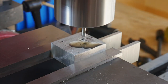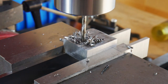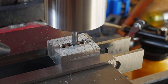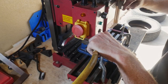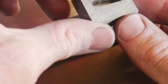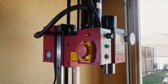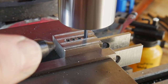Not only does it fit fairly flush, but I also had a very nice square angle when looking at the knife spine up. While the general process for milling out the slot on the spacer was very similar to the guard, there were some key differences. The first is that I used a three-sixteenths inch end mill to start my slot — I went with the more rigid end mill to get the bulk of the material removed before flipping it over and knocking out the eighth inch portion on the other side. To flip and index it to the same spot, I put a scribe line on my vise and lined that up with a scribe line on the spacer.